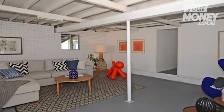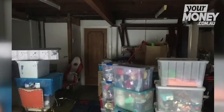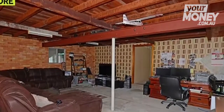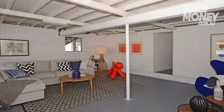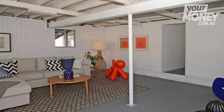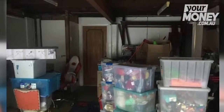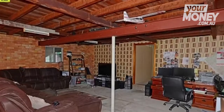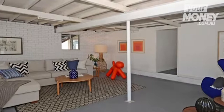You did an amazing job, and we know that you do that. And I love the fact that you've kept the height in the ceiling between those beams and just painted, because a layer of paint is a fraction of a millimetre. Rubber-backed floor carpet tiles are also another solution. They're really low profile, and because they're rubber, you can lift them up if you get water in, because sometimes these areas underneath the homes have damp issues. Also, water can get in, so they're not going to add anything. They're probably going to add 3 mil or something, and they're still able to be lifted up and moved, but they'll also maybe warm it up, because depending on where you are around our beautiful country, it could be cool under there as well, so maybe that little bit of insulation.